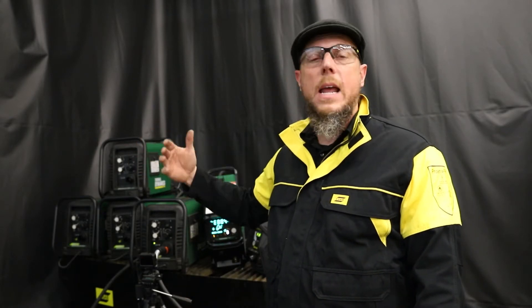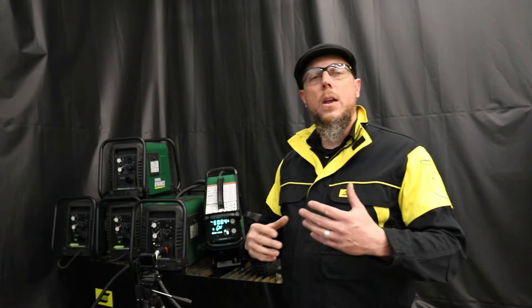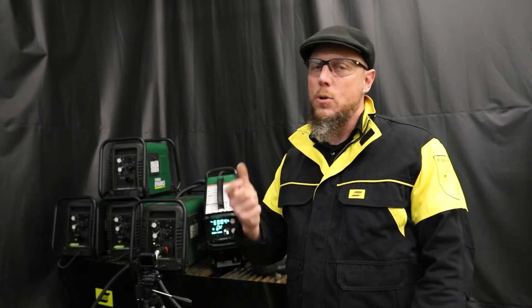What I want to do is introduce you to how each of the types of systems can communicate with you to get you operational. In the legacy products — the 58, 82, 102, 152 — they're going to have a series of lights on the front of the machine. They'll either blink, be amber, be red, or be green. Once you get to all lights green, you should be able to fire that torch and you're off and ready to go.